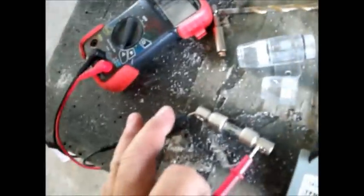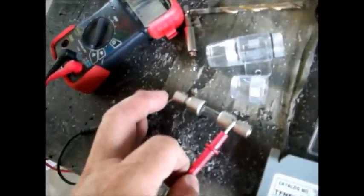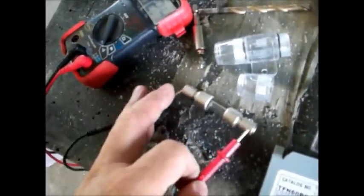Just a little update on the progression here. Getting ready to install my fuse and put up my disconnect panel. Hopefully I'll save somebody some time — this drove me nuts. Hopefully you've got a meter tester so you can check continuity. Hear that noise? You don't get it on this end, you don't get that tone — your fuse is no good.